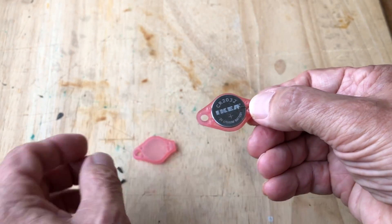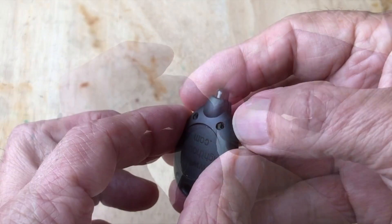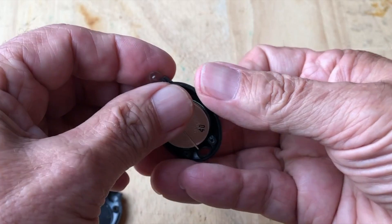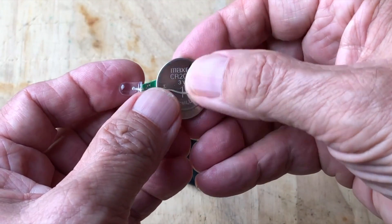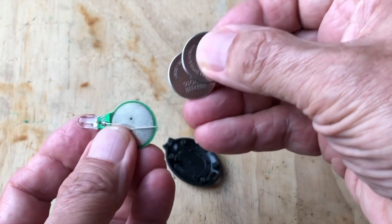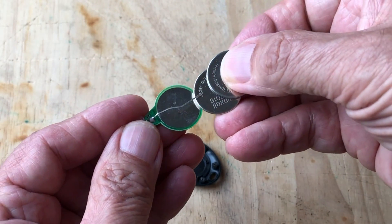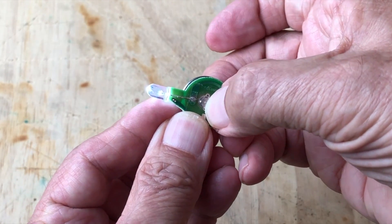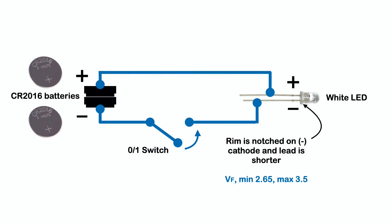The small flat spot in the LED rim indicates the negative lead. Other LEDs, such as white, operate at a slightly higher voltage and use two 3 volt CR2016 cells stacked in series to provide about 6 volts. This particular light's construction differs in that it has the LED and switch located on a printed circuit board, allowing a click-on-click-off feature. A white LED may operate in the range of 2.6 to 3.5 volts, where its maximum intensity comes at its highest forward voltage, or VF, of 3.5.